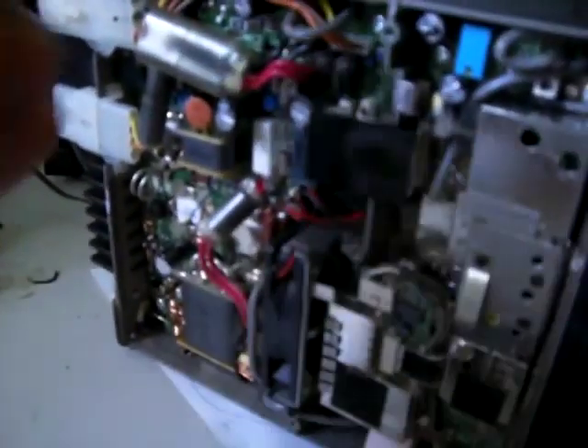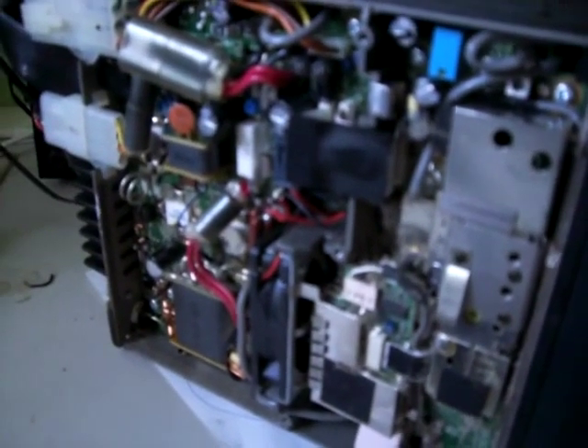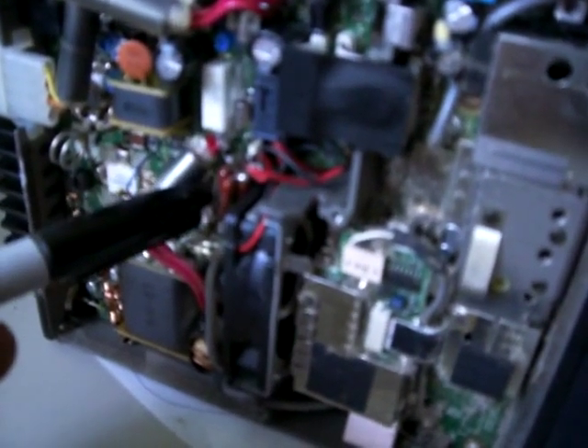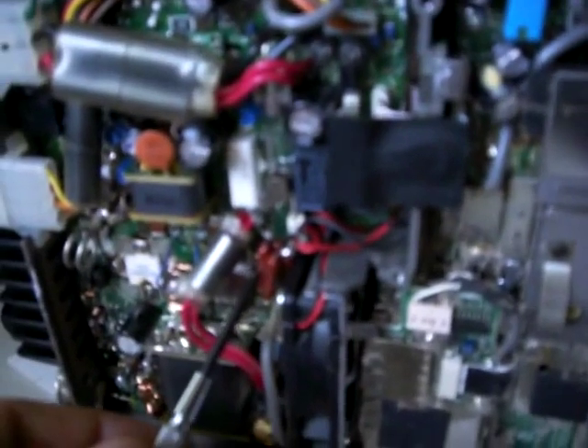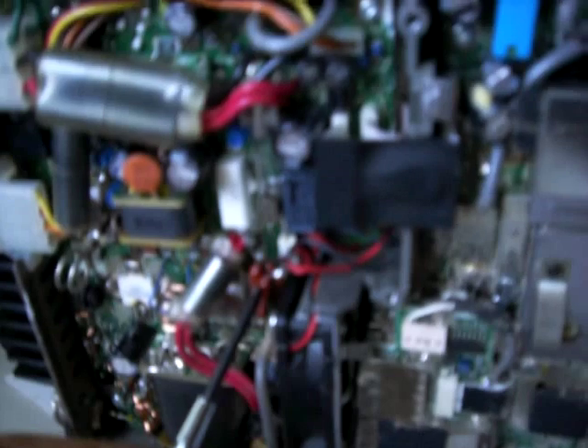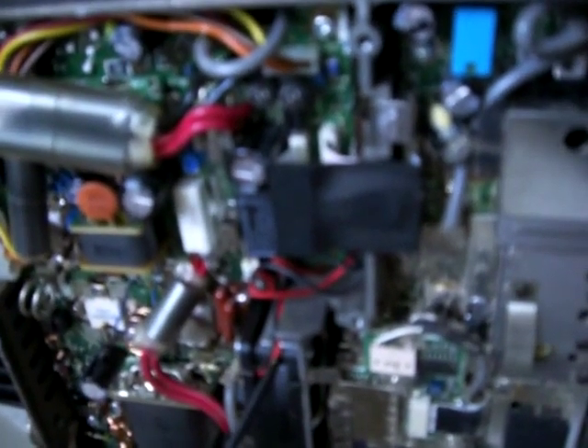If you need this done, since this radio runs real hot, I've put a resistor in line — a couple of them, actually. From the positive lead — this is the bottom side of the radio — from the positive lead to this resistor right here. Then it continues and goes back up to the positive lead of the fan. These are 100 ohm, one half watt resistors. There's four of them. There's two here in parallel, and two here in parallel.